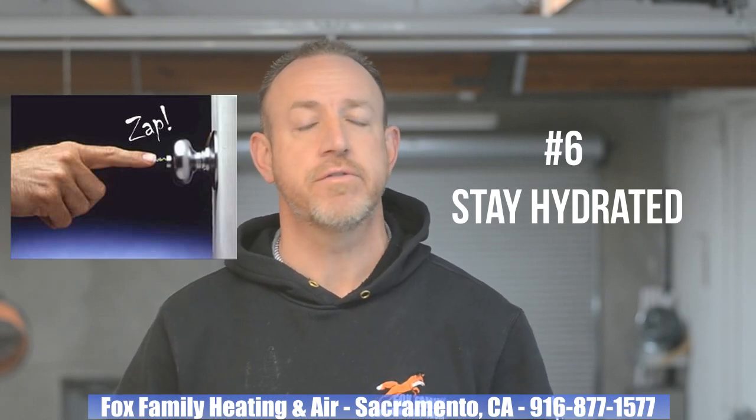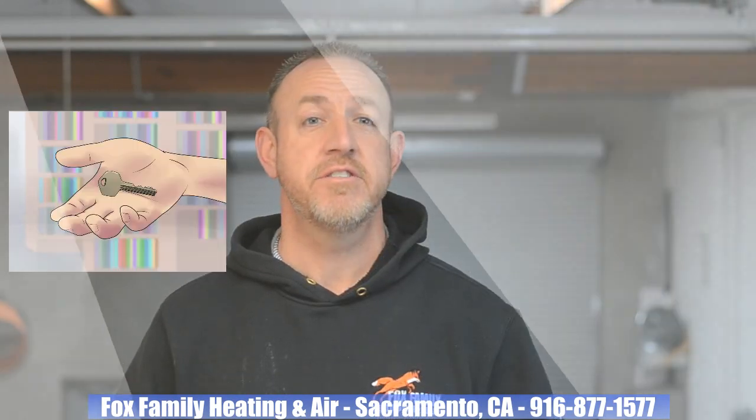Speaking of hands, keeping your skin moisturized by drinking plenty of water and even using lotion will help keep static electricity down. Dry skin encourages static to build up even after you've grounded yourself the first time. You're not off the hook as far as static discharge goes, so grounding yourself to the furnace multiple times isn't unheard of. And here's a little tip.